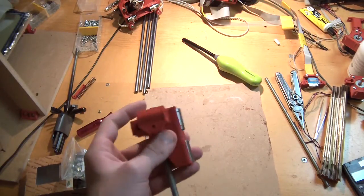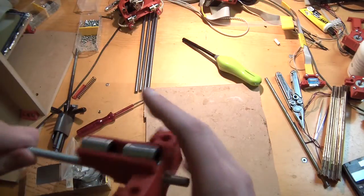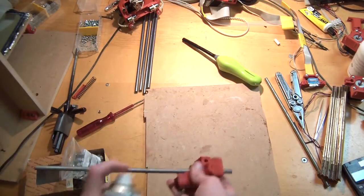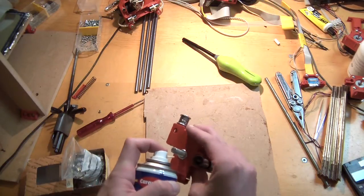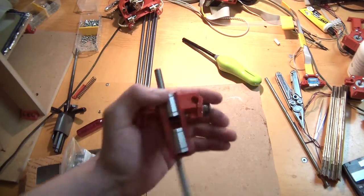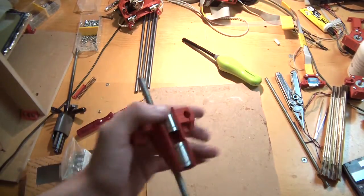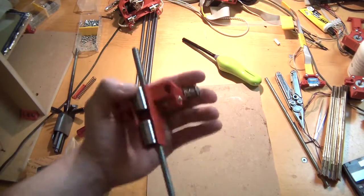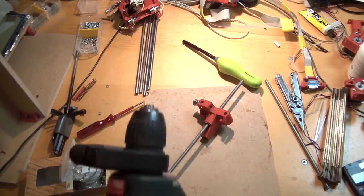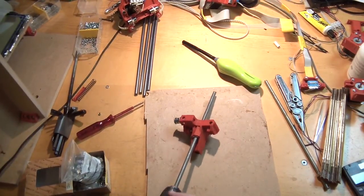Screwing this through is a lot of work. What I like to do is get a drilling machine, put the threaded rod into the drilling machine, and that makes it a lot easier. This is also a good moment to apply some lubricant. It's important that those rods turn as smoothly as possible, because those are the motors that need the most torque to turn the rods and you have two motors on one. You cannot really apply too much current to them so they don't have that much torque, so you want it to go as smooth as possible. You can use an electric drill attached to the threaded rod to make everything work a little bit faster.